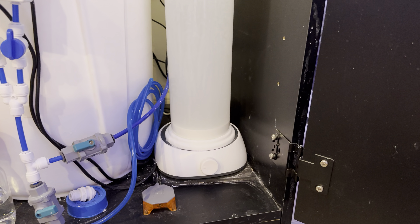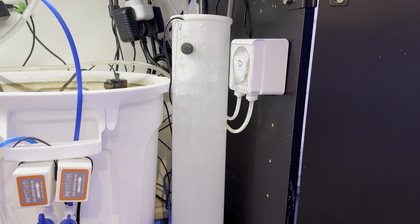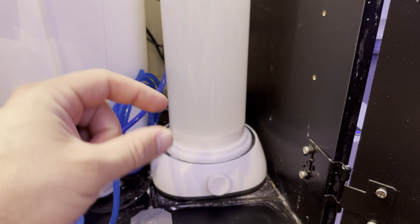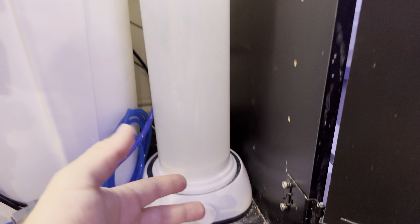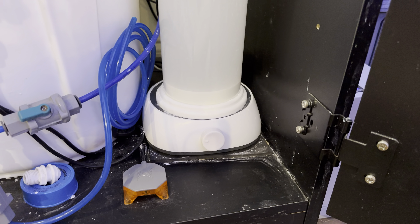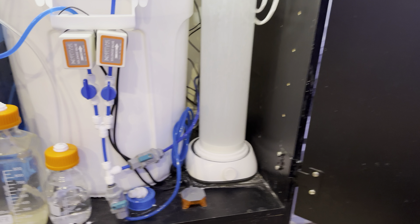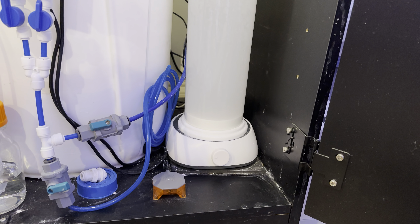After I had the core of the reactor together, I noticed Devon had mentioned that the little magnetic stir pill was carving out a notch in the soft plastic at the base of the chamber. So I went on eBay, found a glass maker, and ordered a small round piece of glass that I submerged and placed on the bottom of the chamber.